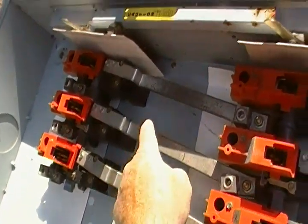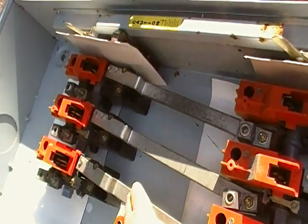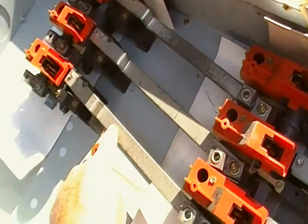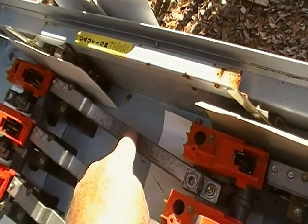This is a three-pole transfer switch right here. So if you have a home, you're only going to be using two poles for your hot. Probably what I would do is use this one right here for the neutral — the white wire — and your L1 and L2.